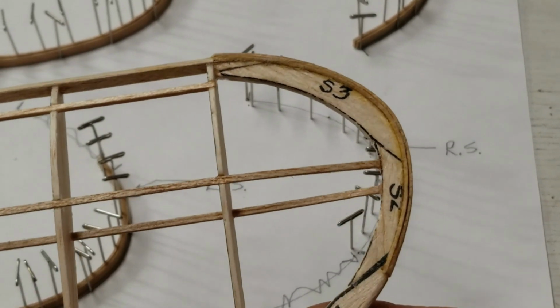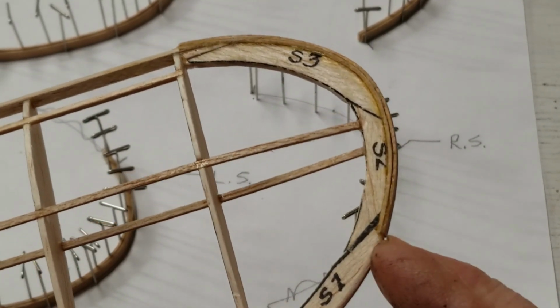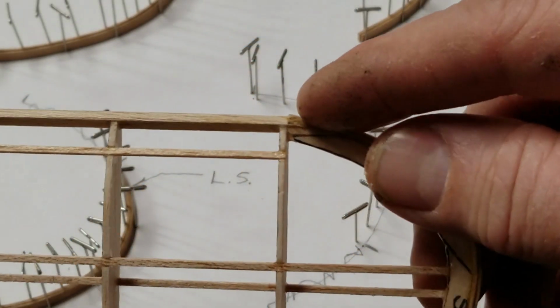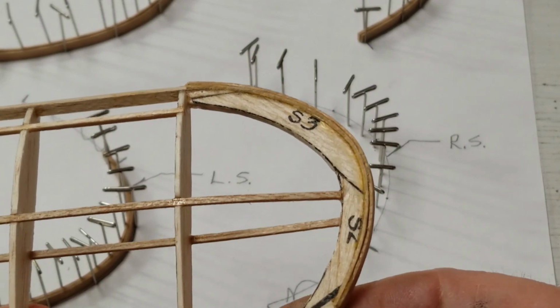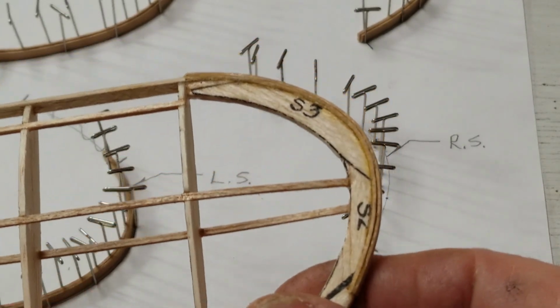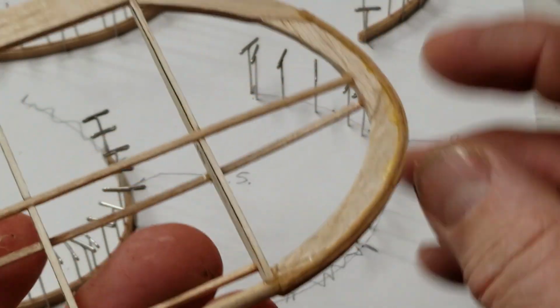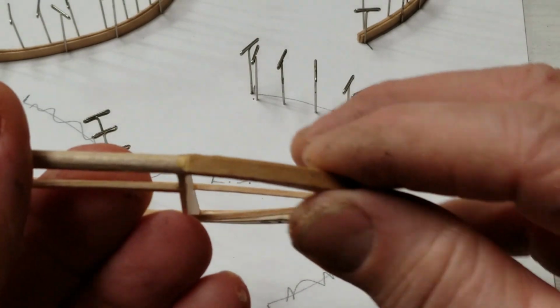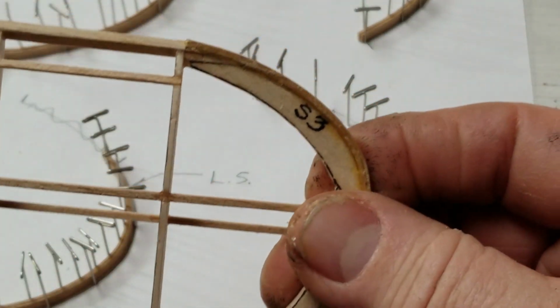Here's a closer look at the tip laminated on the stabilizer. I have tight butt joints on both ends and throughout the tip. There's no question this is much tougher than the wingtip. And I have it centered on the tip so I can sand the radius back on it.